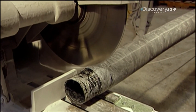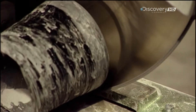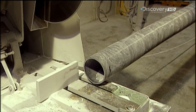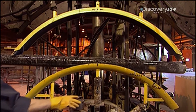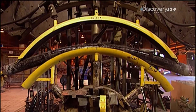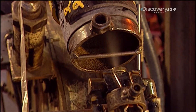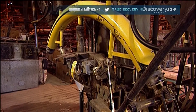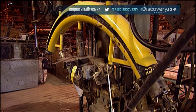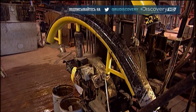Now a saw makes a neat cut at the top of the pole, where the metal tenon will go. A tenon is the component that will hold the light fixture to the pole. This particular model has an arched mounting arm. The composite has cooled a bit since curing, so they reheat it to make it flexible. After a bending machine makes the curve, they spray cold water inside to cool the material. This registers the curve in the resin's memory, setting the bent shape.